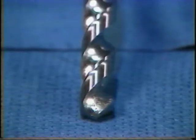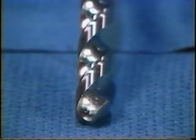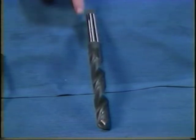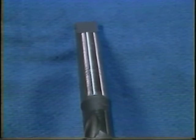This is a tapered length fast spiral drill. Notice that this drill has more twists per inch than the standard twist drill. The purpose of this drill is to rapidly remove chips from the hole; it is used for high-speed deep hole drilling. This is a tapered shank drill — the shank, which fits into the drill sleeve, is tapered. There are many different sizes of these drills with the same size shank, allowing the drill size to be changed without having to change the drill sleeve.